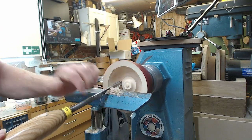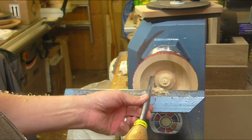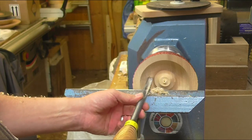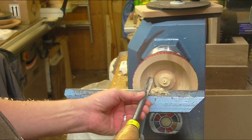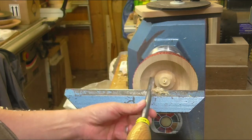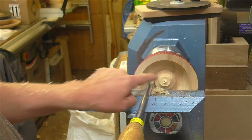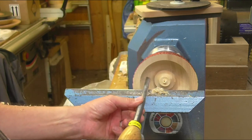One way also of preventing a catch in that bottom: the flute now is at nine o'clock. If I had the flute at anything other than nine o'clock — three o'clock the other way — that bottom wing will catch on there at three o'clock. Wallop — it would throw me back to the side.